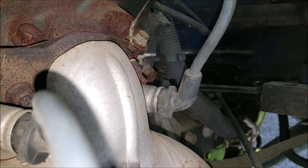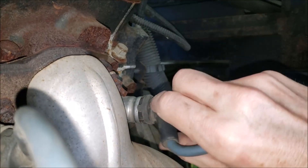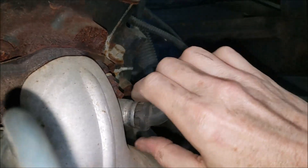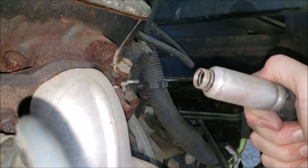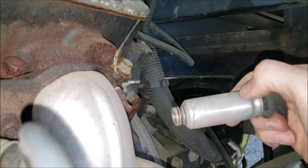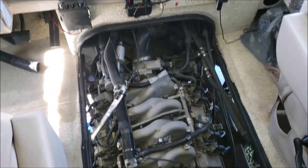I'm on the other bank now and I think I've got a better way of doing this. Pull the top wire loose, then when you come to the bottom, give it a full twist. That way you know the rubber is broken free of the ceramic before you take it off — it gives you room to twist it. Then you can just twist and pull it off. Even if it's still pretty snug, giving it a full twist means the rubber is broken free of the ceramic and you're not fighting that part. That's my tip. All wires installed — let's go for a test run.